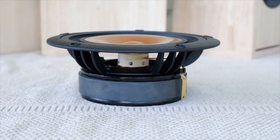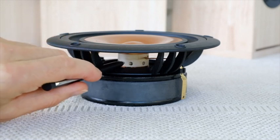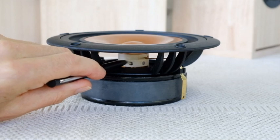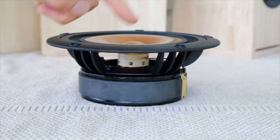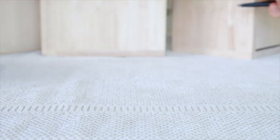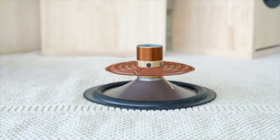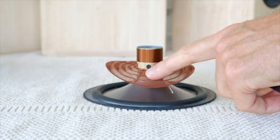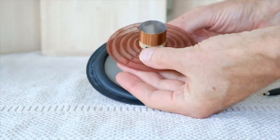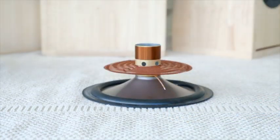Now the reasons why I've experimented with and produced single suspension drivers over the years: the first thing to observe is there really is no spider. You can actually see the top of the coil winding, and if I give the coil body a nudge you can see the whole powertrain move. Let me spend a minute on what a rear suspension looks like — here we go, this is a powertrain from a sister driver, and there's the spider or rear suspension.